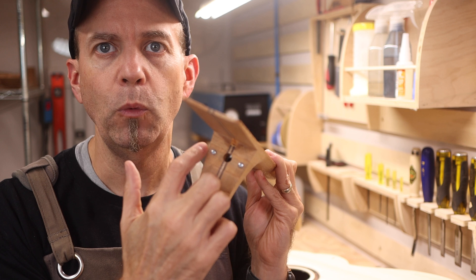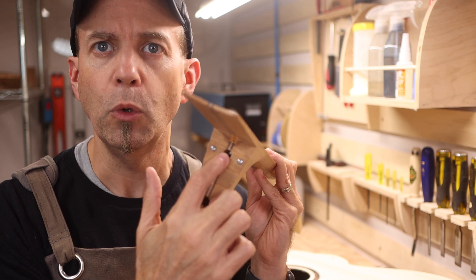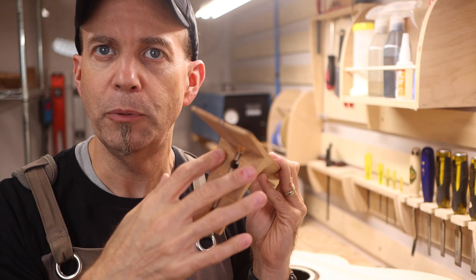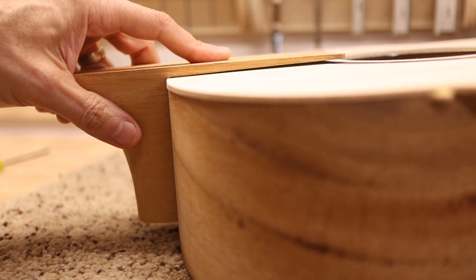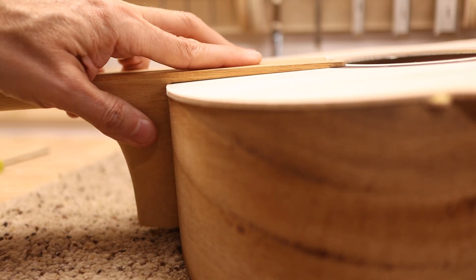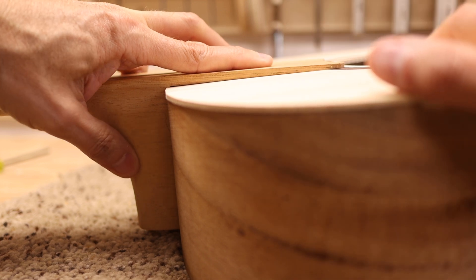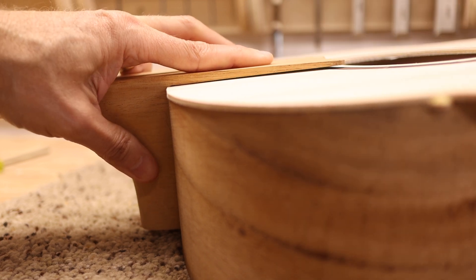It is directly in alignment with this top anchor bolt hole, because we're going to tighten that down and that will allow it all to be a pivot point. As I bring all of these together, all of these angles meet up really nicely — they're nice and flat here — and then we'll have the ability to pivot on those button heads as we tighten down those bolts.